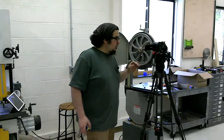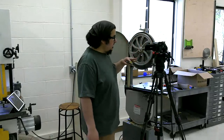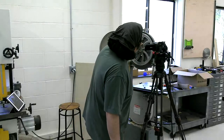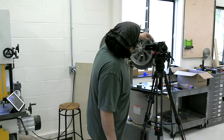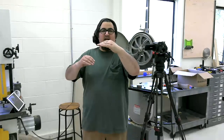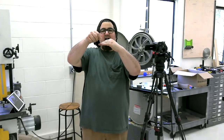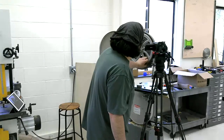And I know a lot of people will say you want the back of the gullet centered on the wheel. If that works for you, keep doing it. This works for me, this works for Michael Fortune, this is what I'm going with, all right? The whole blade is centered on the wheel. And one really great thing about that is this wheel is crowned. So there's a ridge to the surface. So if that blade is centered on that wheel, the teeth have some relief, right? And the teeth should not be digging into that crowned wheel, that crowned tire. This is a urethane tire on here.